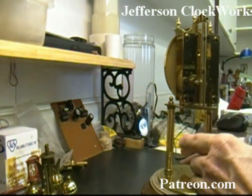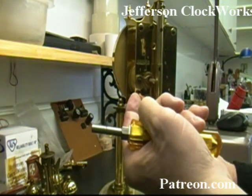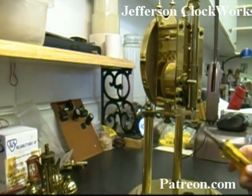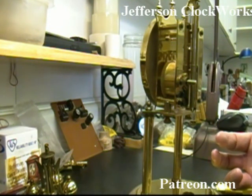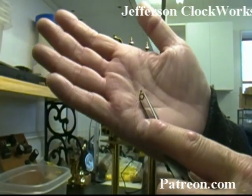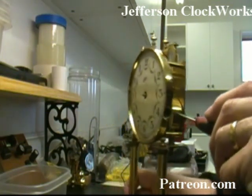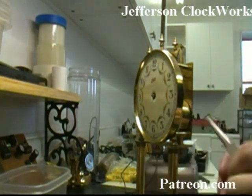Whenever you're working with any kind of a clock with a spring, you have to let down the mainspring. They've got this little click handle that you push up on it. Right now we have to consider this a dangerous clock — we do not want to take it apart, because if we do, that spring is going to jump apart and it'll damage the wheels as well as the pivots. This video is all about helping you build the confidence to identify the little things that will bite you in the butt, that are unknown to you.